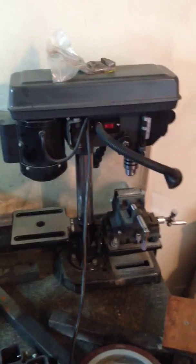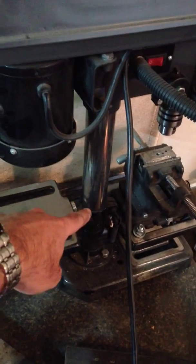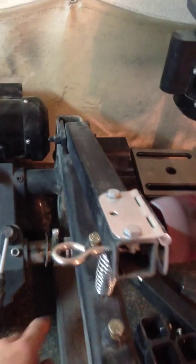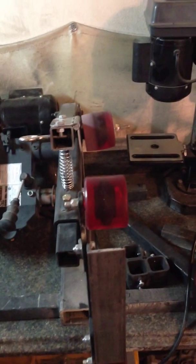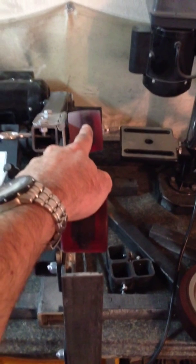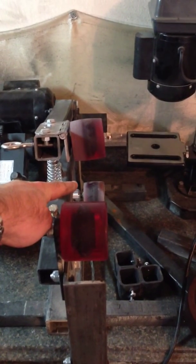I used the base — this shaft, it's this drill press right there. So this is a section of the shaft, the stand, welded to the side, squared up for tracking on the wheels. I crowned my tension wheel and my drive wheel — seems to make it a lot better.